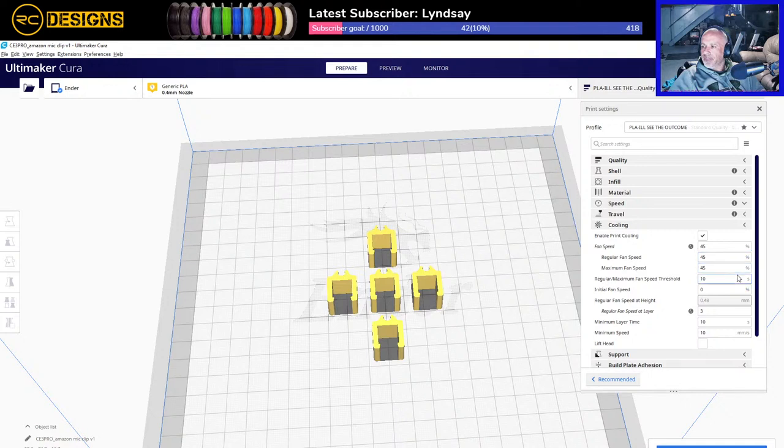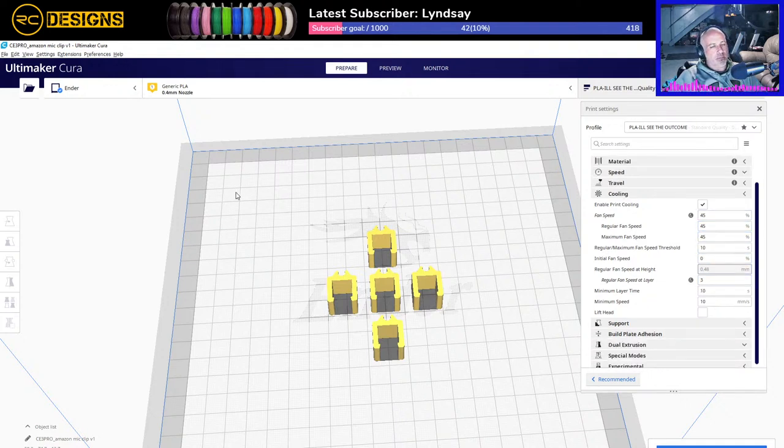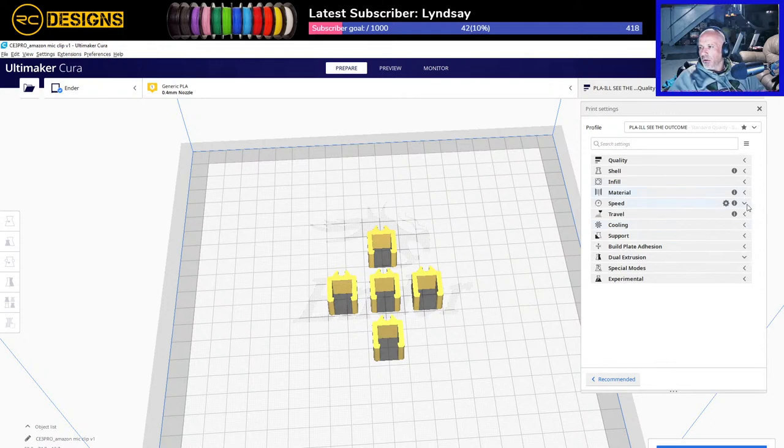My cooling, I'm at 45. The reason I'm at 45 is because I run the Hero 5 with a 5015 dual fans on it, on the part cooling, the original OEM nozzle fan, but new part cooling fans. And cooling supports, obviously, there's no support on here. My skirt around the outside, I only do one skirt. And that's about it for there.